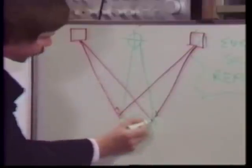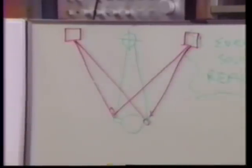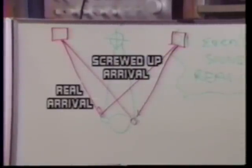But by and by, the sound from this speaker arrives at this ear about 100 microseconds later, 100 millionths of a second, and all of a sudden, the ITD center in our brain has received four arrivals, two per speaker per ear. And it says, aha, sound not dead ahead, two separate sounds located equidistant left and right at the loudspeaker location. And confusion reigns. Now what happens in stereo, obviously, or stereo wouldn't work at all, is that our ITD center is somehow beat into submission, and the IAD center says, well, the sound must be straight ahead. But what happens is it's sort of smeary, it doesn't sound realistic, and you really have to suspend your disbelief to believe that it's a sound that bears any resemblance to real life.